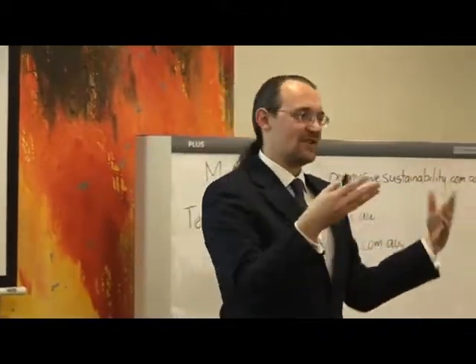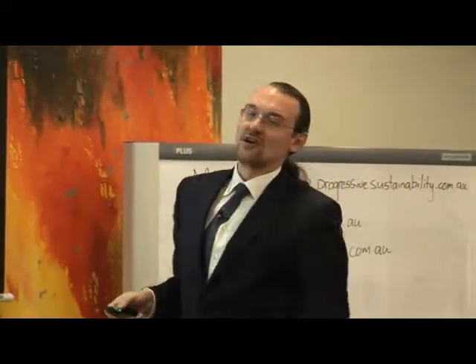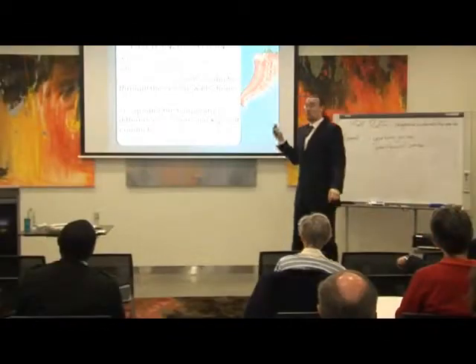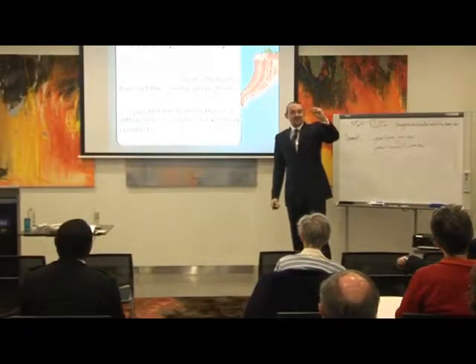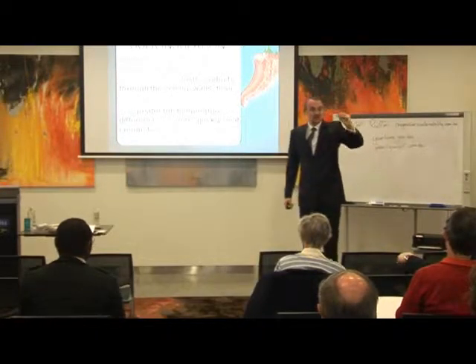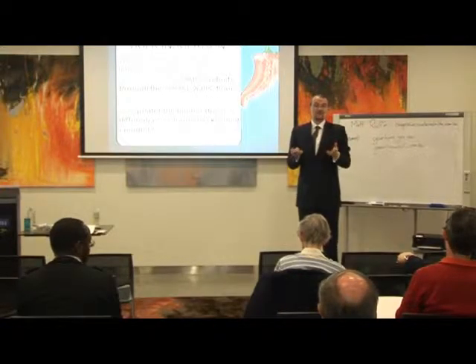That is pink bats — they're not all pink, some of them are orange, they come in grey etc. as well — but bats or loose fill. How does bulk insulation work? Heat actually conducts through your building and this is how you lose most of your heat in winter. Heat goes through the ceiling first, through the walls and windows, and through the floor to a lesser extent. The way in which we slow this down is by trapping small pockets of air. That's what bats do. The bat material actually doesn't do much, but the little pockets of air trapped within the bat is what insulates. Unmoving air is a really good insulator.